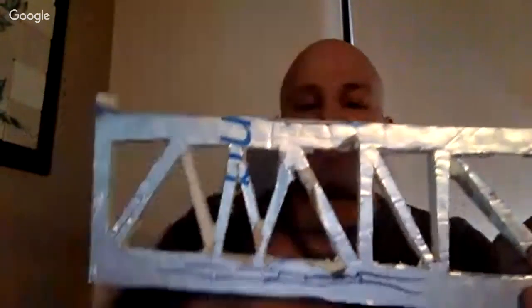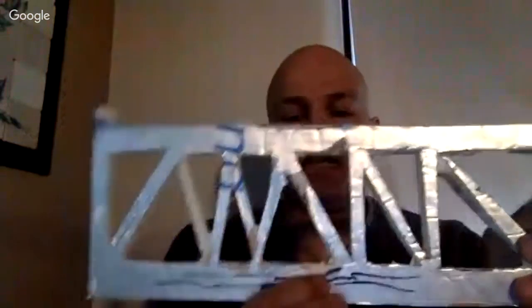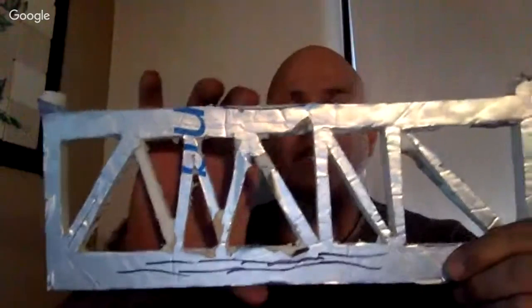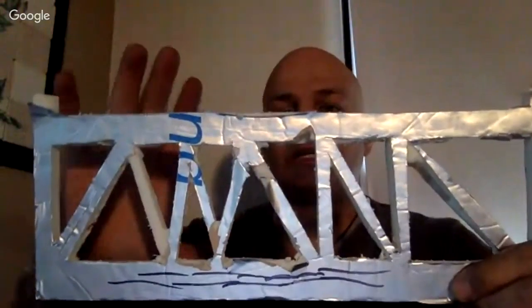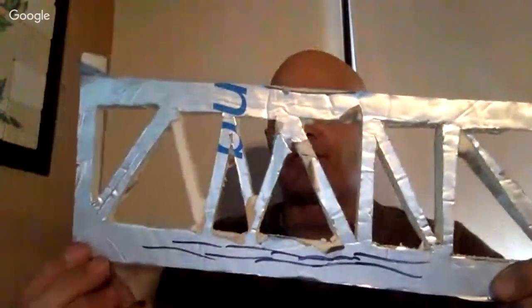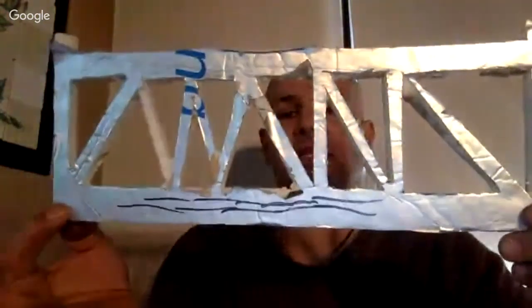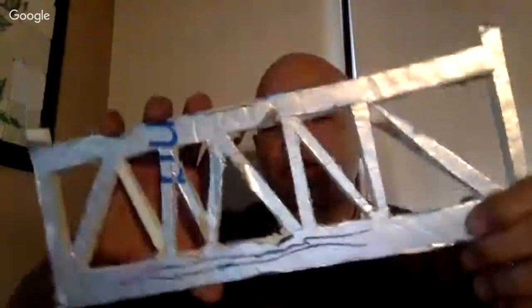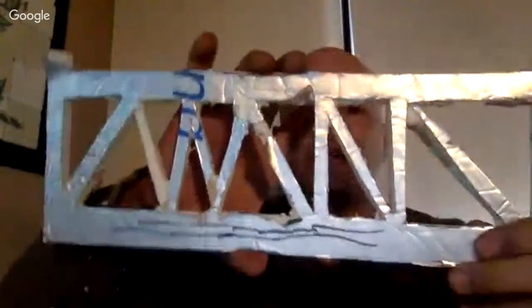The load is still here, pulling. Imagine it pulling down, and that would be equilibrium, right? You can call it gravity. I call it the weight of the bridge trying to find equilibrium. It's clearly in space, and for it to find equilibrium, it transfers its loads out to the end columns. And in theory, you don't want the deflection in here unless they design it for deflection for movement, like the earthquakes, hurricanes, and all the stuff they have down there.